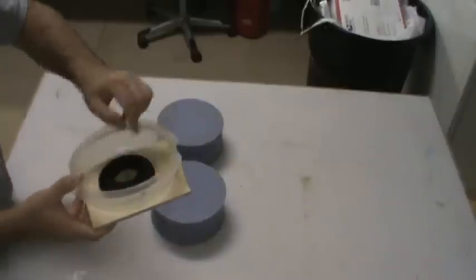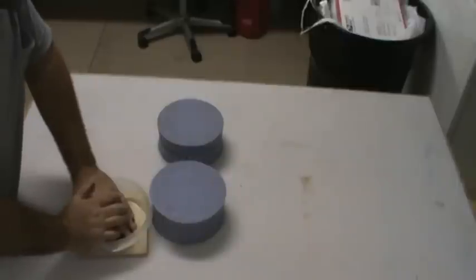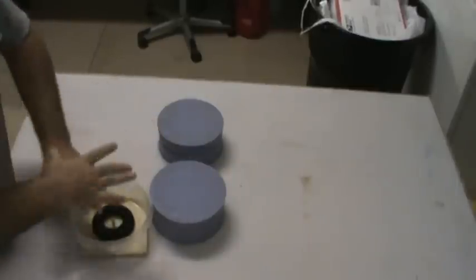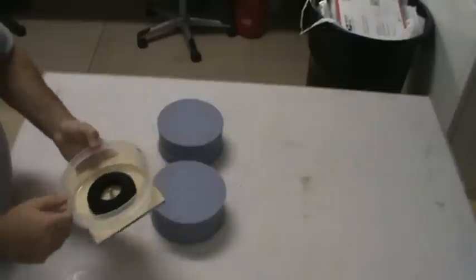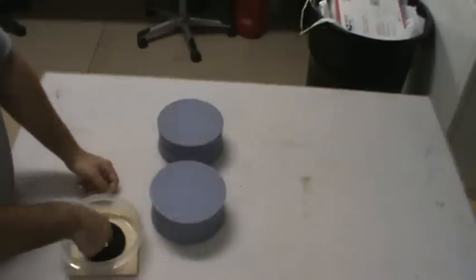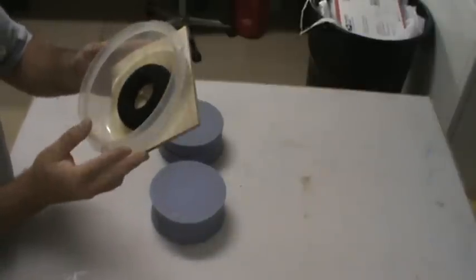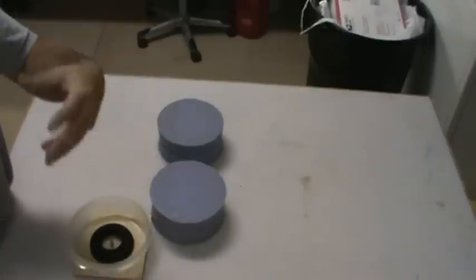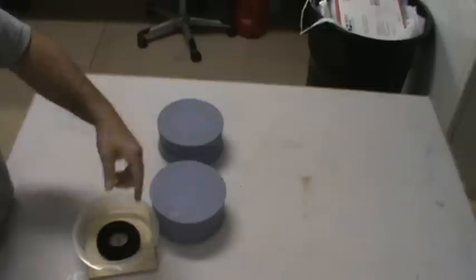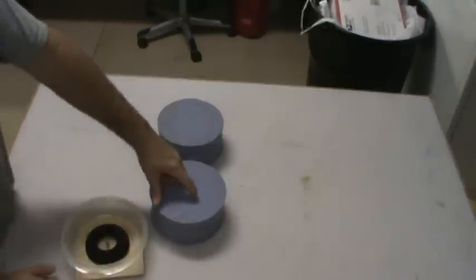The reason for the plywood is I just took CA and put it all on the bottom of that thing, stuck the plywood down on the table, and took a big block of aluminum and pressed it down on the center of the Tupperware container so the whole bottom was nice and flat. Then I took a tire and a razor saw and cut the tire in half. Using the original rim, I drilled a hole in the center of the Tupperware, put a little piece of aluminum tube there, and put the foam tire on the rim — the half foam tire on the rim, about halfway on the rim — CA'd the backside of the foam, stuck it down. This gives you your center alignment pin.